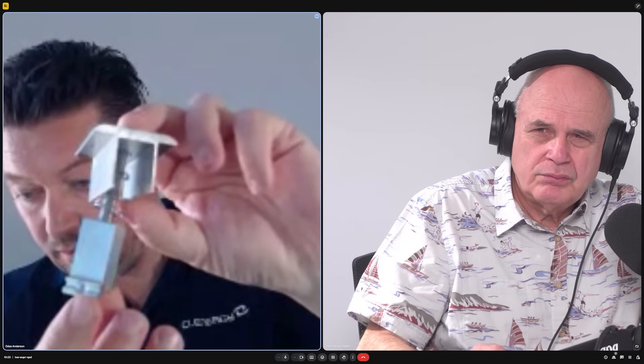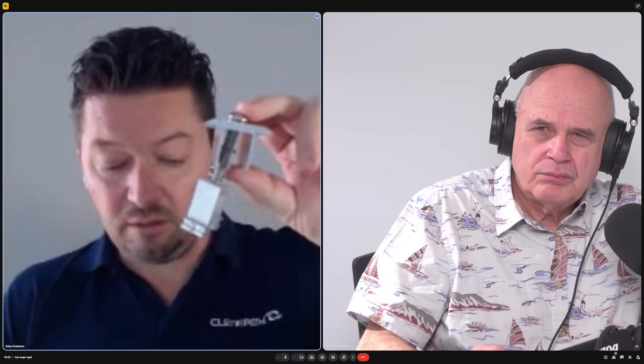For those, we have the newly developed Zano clamp. That allows the same functionality — earthed at the bottom, earthed at the top — with a smart little pin in the channel and a pin on the top. It allows installation for panel heights from 28 up to 42 millimetres, comes in silver and black, and there's also a suitable end clamp in the same design. Distributors would like that because instead of stocking different sizes, if an installer uses panels with different framing thickness, they can go with one clamp and only need one lot of supply.